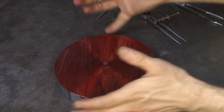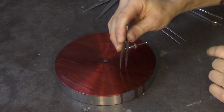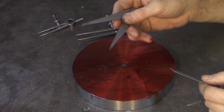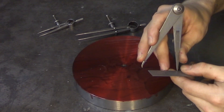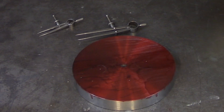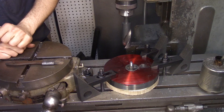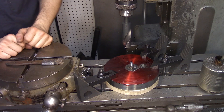We'll do the layout the usual way with dividers for the holes. I've got some punch marks already in there and I'll do my straight lines with odd-leg calipers. The way I like to set these is to put the scriber on the mark and move the odd leg until it strikes the end of the ruler. I'm about ready to start drilling the one-inch hole — the three-quarters came out fine, although even on the slowest speed this old Bridgeport head is way too fast for running a one-inch drill.